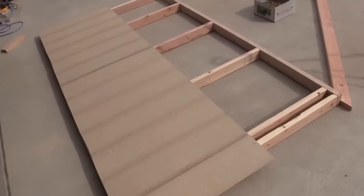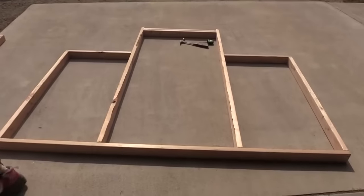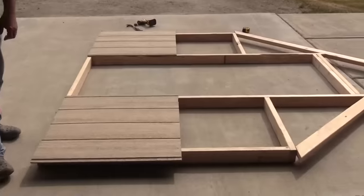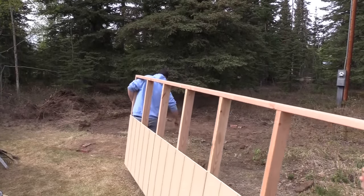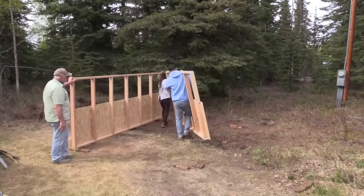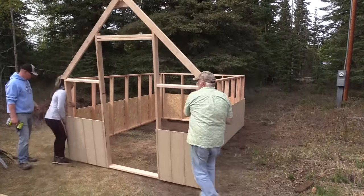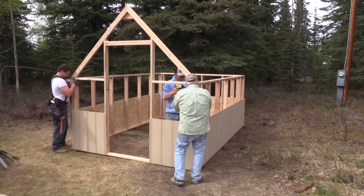That's the back wall and back wall rafters — not actually attached yet. Now let's work on the front wall: the door is laid out with the rafter attached to it, and we're attaching the siding panels. Our uncle wanted an overhang, and we attached the siding panels at the workshop because we were hauling everything out to the location and didn't have all the tools there. At the site, we've got some paving blocks set to grade, and Uncle Bill later put in a row of treated 2x4s underneath. What you choose for a greenhouse foundation really depends on your yard.